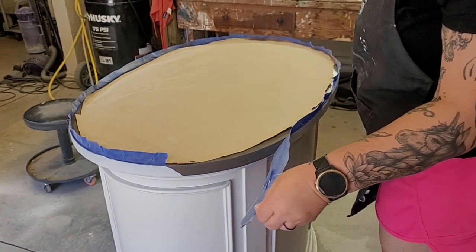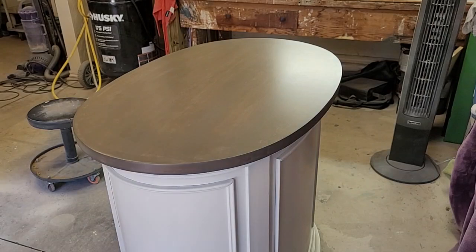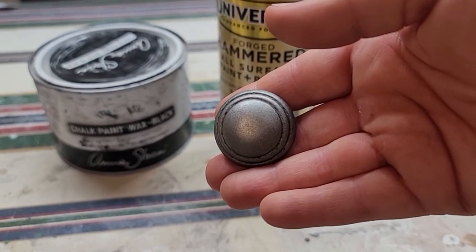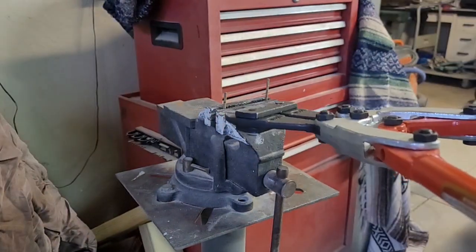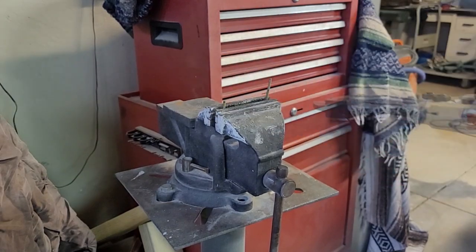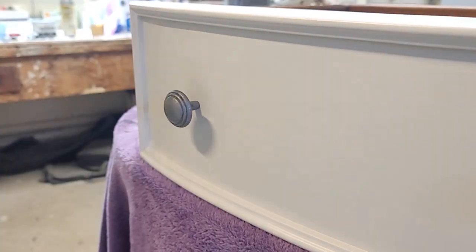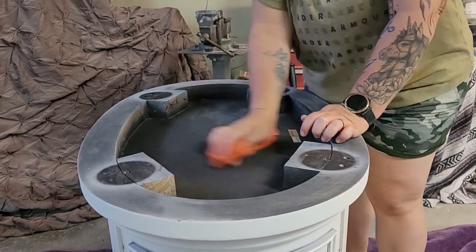All the spraying is finally done, so I removed the cover top to reveal the two-tone farmhouse-ish look I'm going for. I kept the handles original to the set and sprayed them first with Antique Pewter by Rust-Oleum, then covered them with Annie Sloan's Black Wax for an antique silver look. Since I removed the appliques from the front of the drawers, the screw knobs were now too long, so I used bolt cutters to trim them down. Then I removed the original legs, wiped down the bottoms, added furniture glides, and this piece is done.